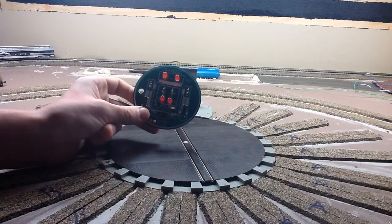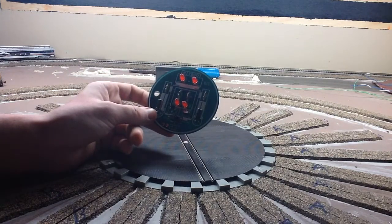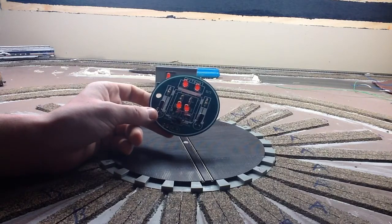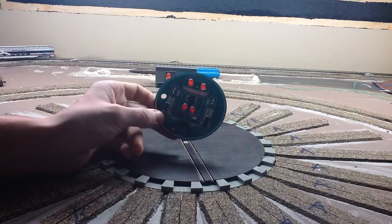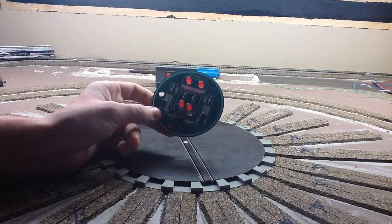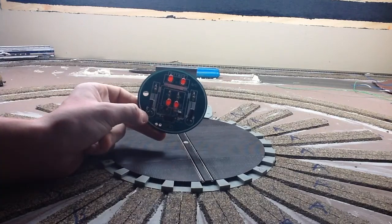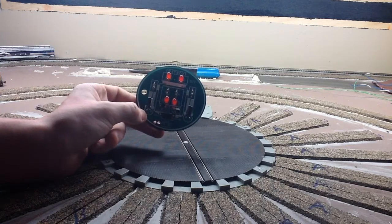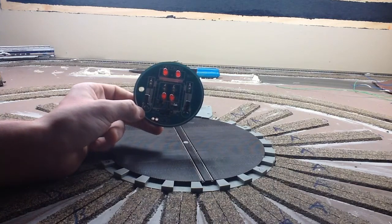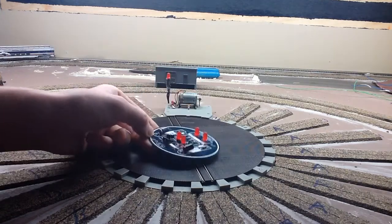These do not flash at very particular intervals. It's however you wire it. You can wire in the resistors and capacitors in any polarity you want, and they'll work. The LEDs do have to be in the correct polarity though, or else they will not work, because the LEDs are polarity sensitive.